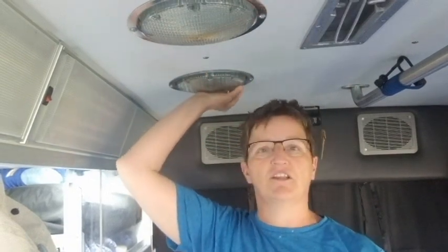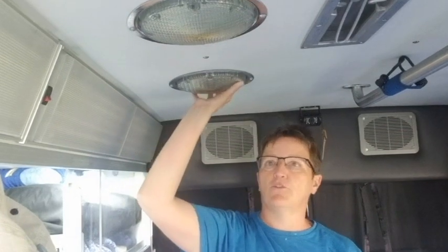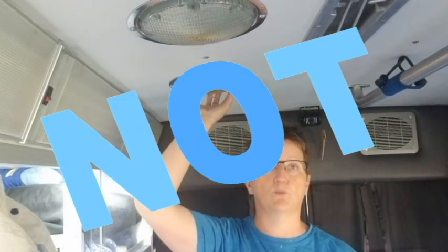This is already on a switch and she does not need these lights. We're going to take all these lights out and she's going to redo the ceiling so that the Max Air Fan is wired to the switch. We won't have to run any extra wiring — makes it super easy.